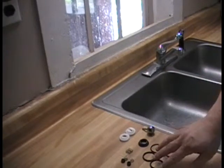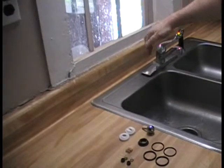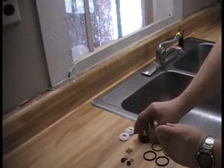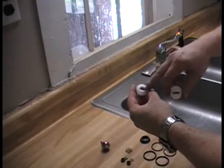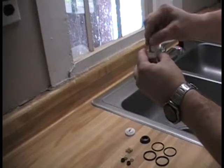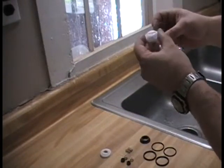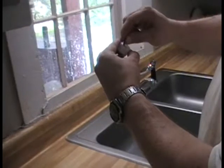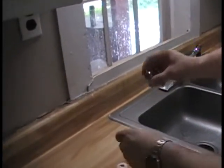There are also O-rings that go inside underneath the spout to keep it from leaking around the outside. There are two plastic caps — one for a faucet and one for a tub. The triangular one is for a faucet; it allows the ball to go hot, cold, on, off. The tub version uses a different ball but the same principle — you turn left or right for hot and cold, and it has a football-shaped stem instead of a round one.